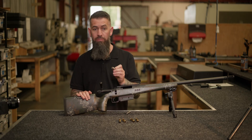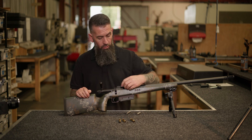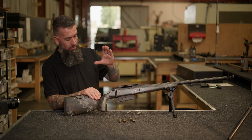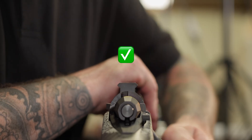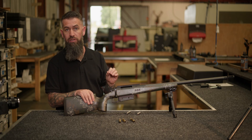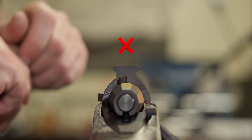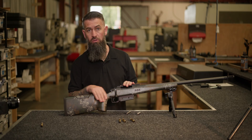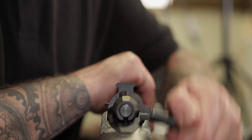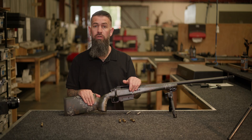You can use that to size your brass. Size the brass, load it into the chamber, close the bolt, and then look at the indicator. As you see the bolt lower, you'll see the indicator disappear more and more as you get closer to achieving the perfect headspace with your brass. If you can see the indicator, it means you haven't sized your brass enough, and chances are the rifle will not go off. As soon as you size your brass enough so that the indicator is completely gone, completely disappeared, you're good to go — it'll always go off.